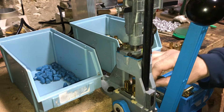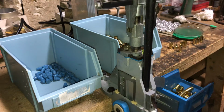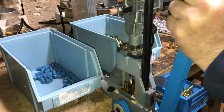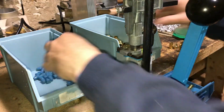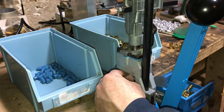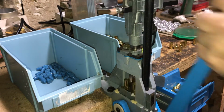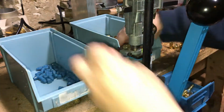Of course, I let it sit on top of the pot when it's heating up and melting the lead, and I use the PID. I set it at 715 degrees is what I cast that mold at. And when I set it there, usually, like I said, a couple casts in, and I'm getting good bullets.